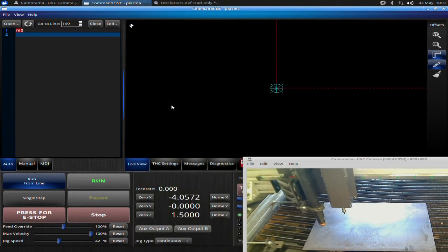That's Output B — that's where you want to have that plug plugged into. Now if you have it plugged into the correct spot, I have the standard plasma cutting profile pulled up here. With air pressure applied to the regulators and the electrical plug into Output B, if I come down here and click Output B, that allows me to engage the slide. That indicates that everything's set up properly.